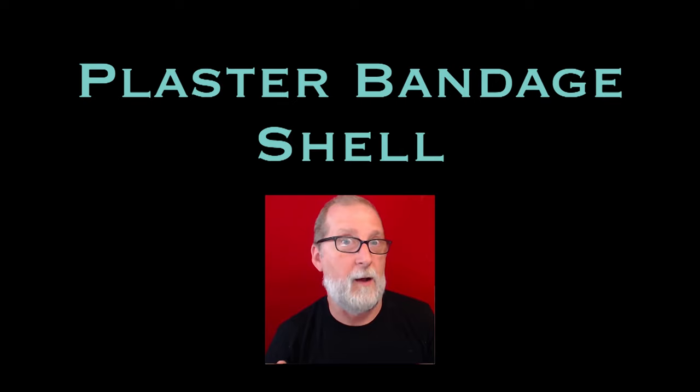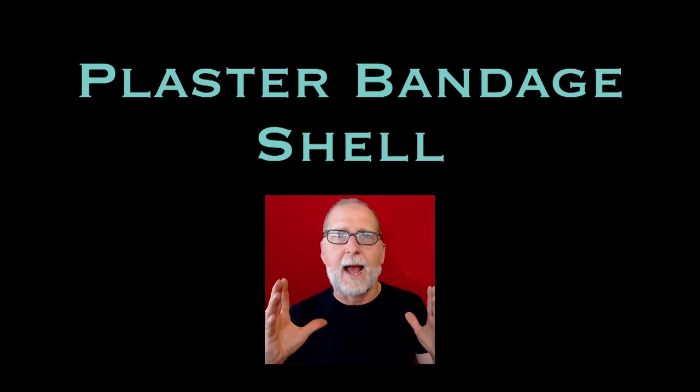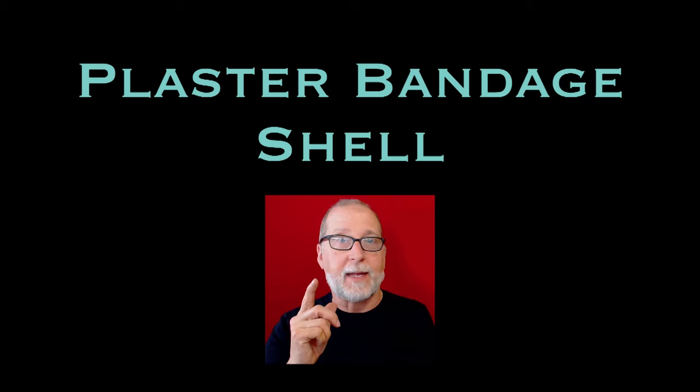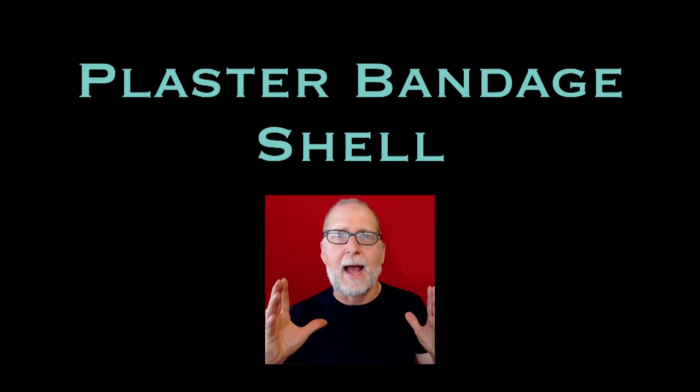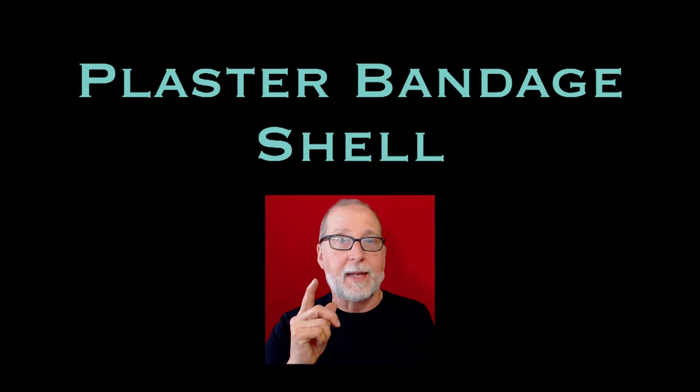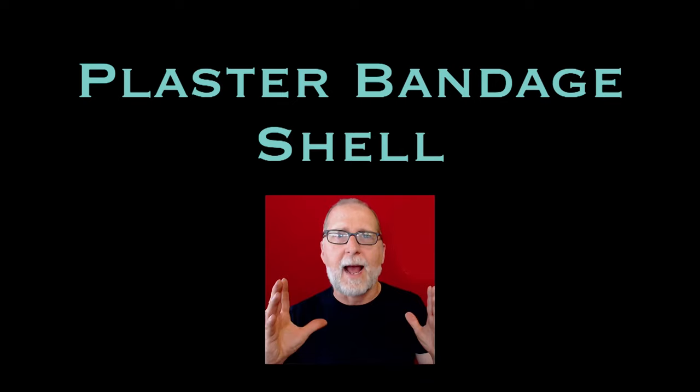At this time, we're adding plaster bandages. The first strip that will be going down will be the front half of the shell. Make sure that the strips don't go behind the ears. If it does, it'll create a lock, and it'll prevent the shell from coming off. All the bandages are doubled over either width-wise or lengthwise when applied. This will speed up the process by putting two layers down at a time. In the end, there will be at least four layers over the entire head and at least eight layers on the edge.